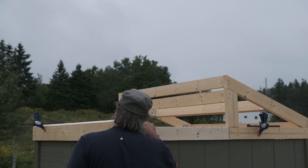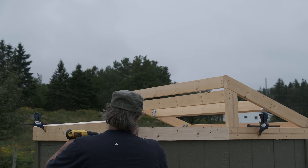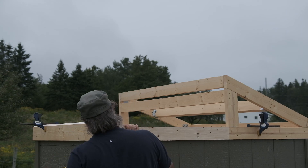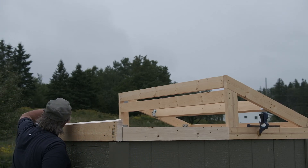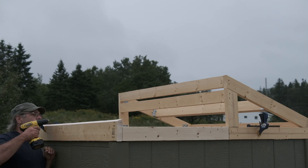To be frank, I built this entire structure to be really strong. That's why I built internal walls and over-reinforced all the framing. There are about 50% more struts in the walls than there would have been with an ordinary build. Everything has been built to be really strong because I've been through hurricanes before and they're rough. All I have to do is finish making this half of the roof frame, then batten it down to the main frame of the observatory, throw a couple of heavy tarps over it and anchor them down with cargo straps — and I expect the observatory will ride out the hurricane pretty well.